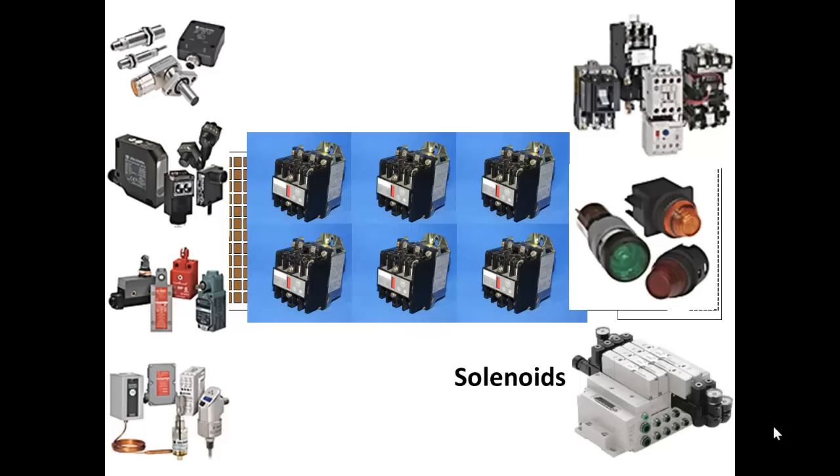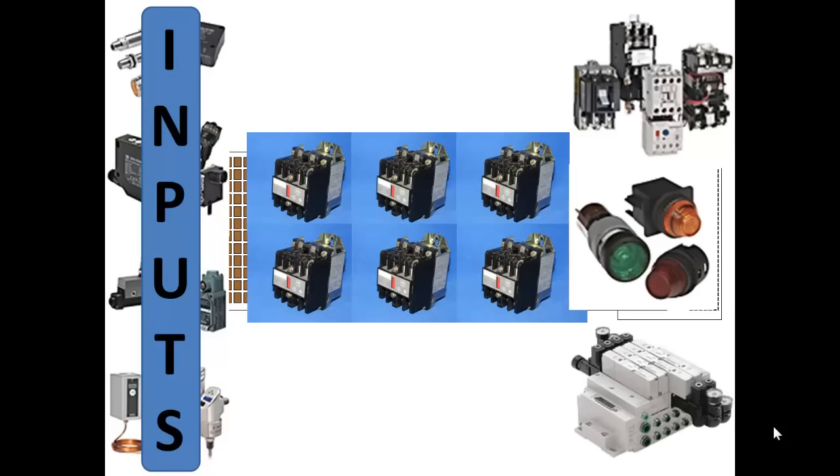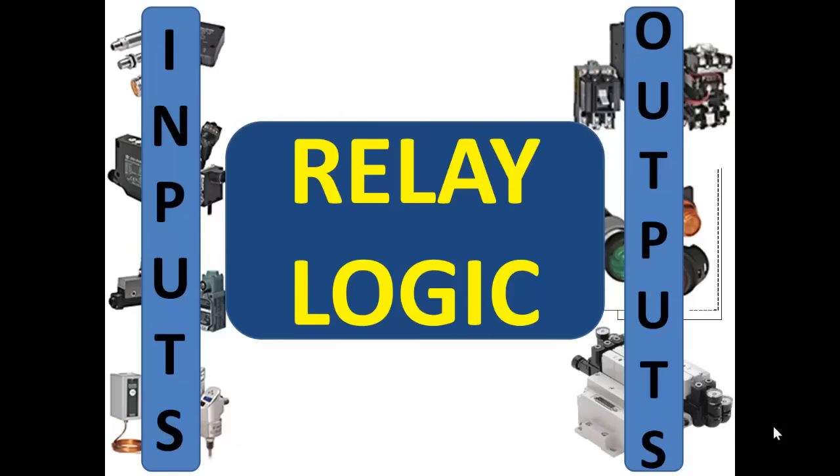Although a real relay panel would not be arranged this neatly, the idea is the same. There are relays that are energized by means of input devices. There are relays that are strictly internal to the logical machinations of the process. We call that relay logic. In other words, they don't directly respond to an input device, but they might respond to a group of input devices, so they're logical relays. And then, of course, we have relays that switch the output devices on and off as programmed.